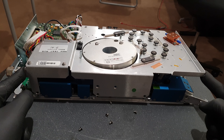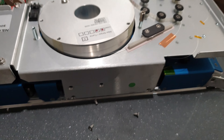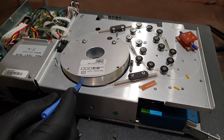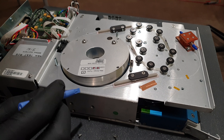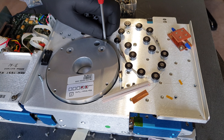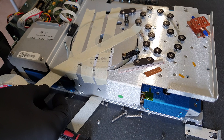I've removed a few screws and I could now flip out the upper floor. But there is this section of fiber which is neatly wound on this massive slanted aluminum cylinder, while right next to it there's this loosey-goosey arrangement. Kind of makes my spidey senses tingle. If they went through so much effort to wind this thing neatly, I don't think I should mess with it, let alone unwind a length of fiber to have enough freedom for the unfold. I'm going to try to suspend the heavy cylinder on the top floor itself with a couple of 3D printed parts. That's still highly precarious because the smallest movement could damage the neatly wound fiber in the small gap between cylinder and plate.